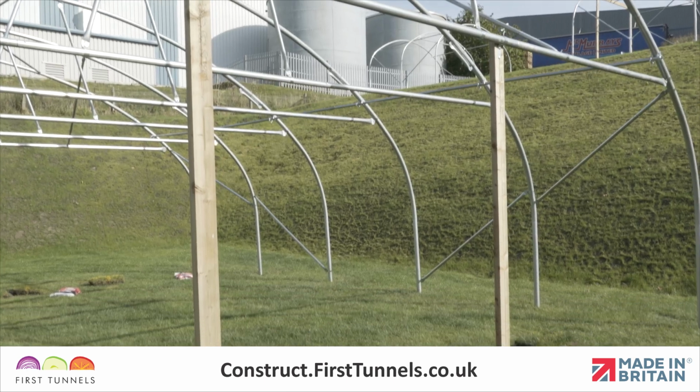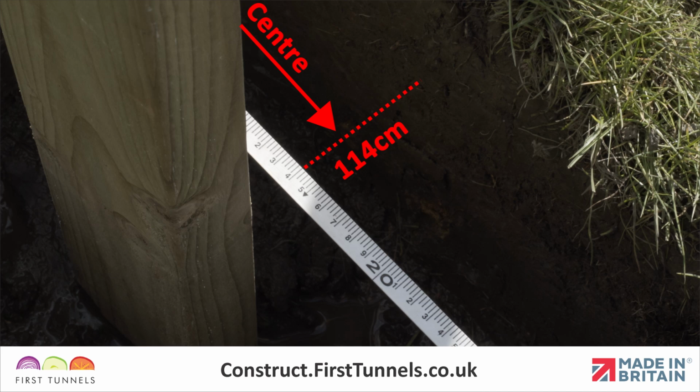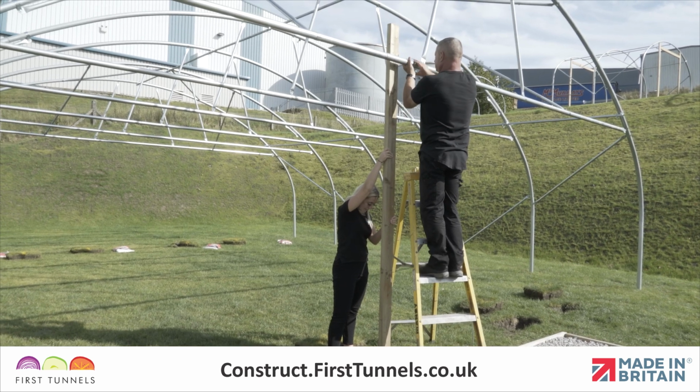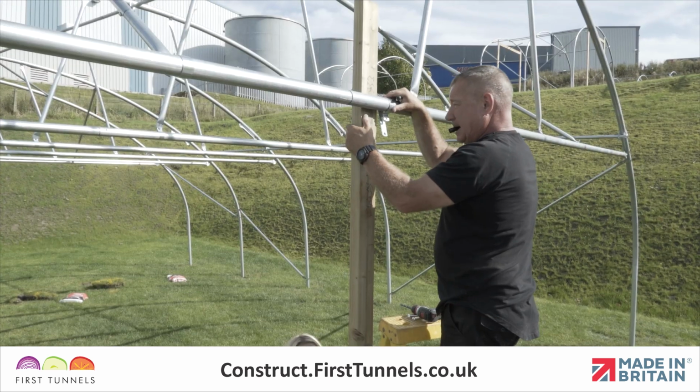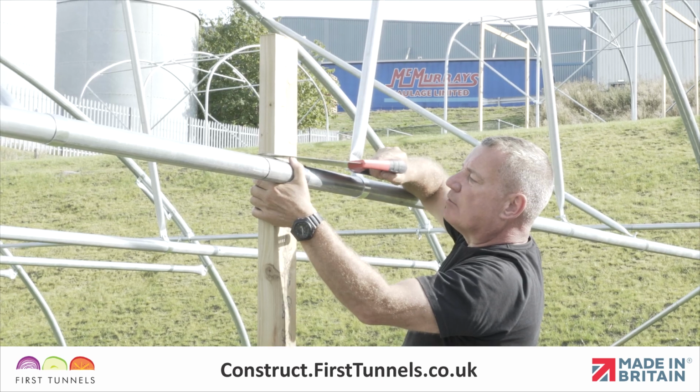We will now install the 2 inner door frame posts. Reposition one of the door frame posts into the hole or onto the solid base, ensuring the door frame post is positioned 114 centimetres from the centre mark to the outside of the door frame post. The 2 inner door frame posts will be fitted to the rear of the door rail. They will exceed the top of the door rail and will be required to cut down after fitting.